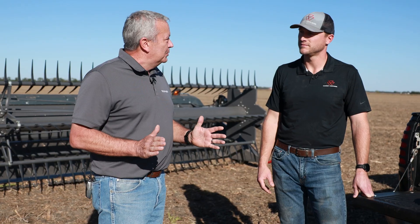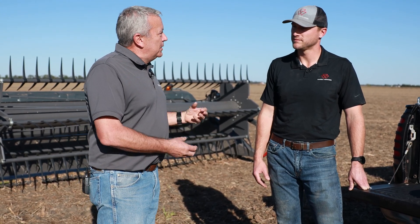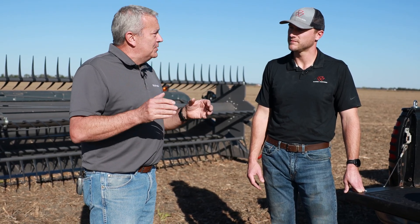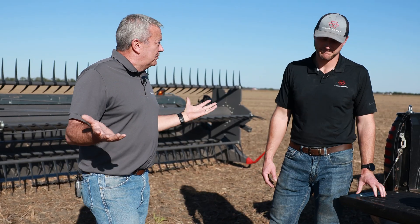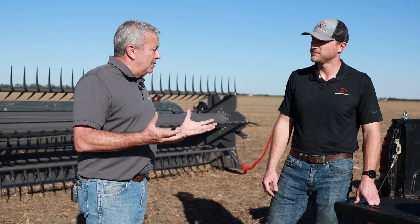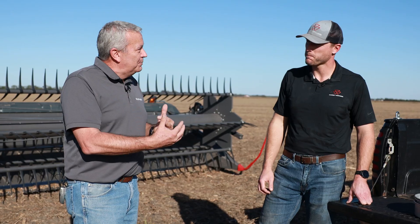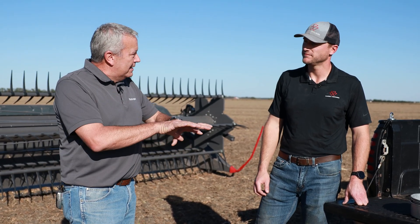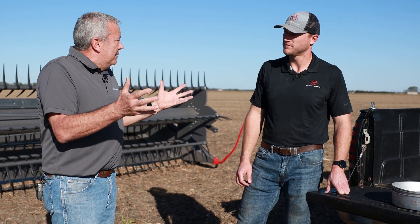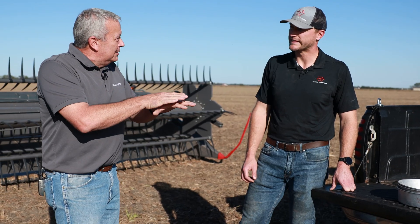It's the design of the combine. When we bring that crop into the combine, we bring it in at the width it's going to enter into the processor — 39 inches — and then that crop material makes two and a half passes through our processor, never changing direction. It's just a natural flow — that's where the name comes from. We're not twisting or turning, so there's less damage to the crop. Then we get into the cleaning portion: we have distribution augers and accelerator rolls that shoot that grain down nice and level onto the shoe at about four times the speed of a gravity drop.